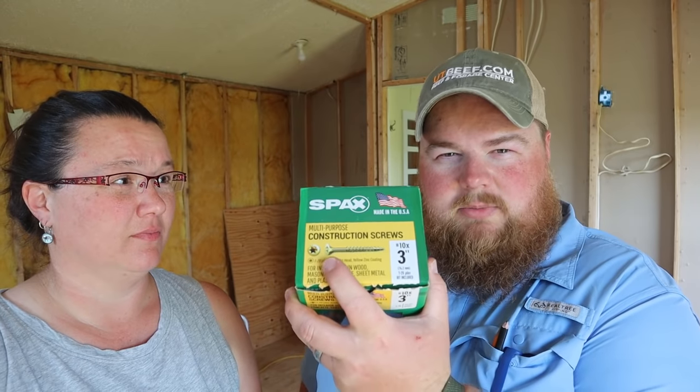I say that not because we're sponsored or anything, but just to share that if you're in the store and you wonder about these green box Spax screws, they're pretty good. I like them. They are Torx drive, which is hands down the only kind of screws we would ever recommend anybody getting. Phillips jump and strip out and they're terrible. Torx bit drive at least are good once they get going. They might be a little hard to start, but then you're good to go.